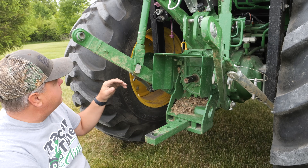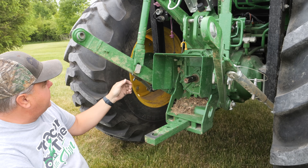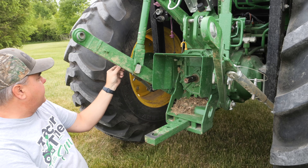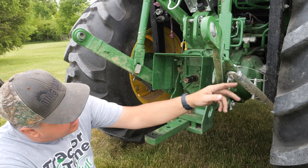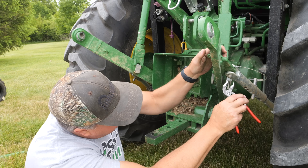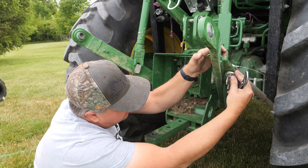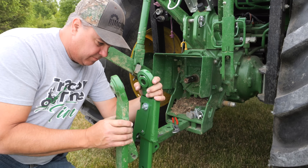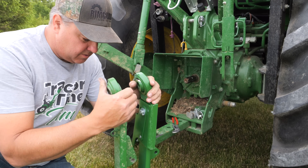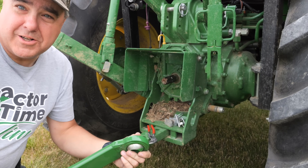I'm going to get down close so you can see what's going on. This is the only piece we're going to replace — we're keeping the same lift points. There's one piece that needs a cotter key removed; the rest are easy quick-connect clip keys. I'm going to stand both arms up beside each other — you can see they are the same length, so we're good. I'm a little confused why the top link is shorter, but we're not going to use it anyway.